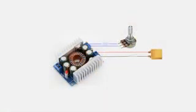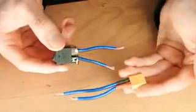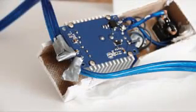Now solder on a female XT60 connector and a switch to the regulator's input. This type of connector is well suited for high current applications, and it is frequently used with LiPo batteries. Remember to use heat shrink over the solder joints to protect against power shorts. Now make a little enclosure for it out of MDF, but make sure you leave the heat sinks exposed as they will get quite hot. Now you can solder the LED panel's power wires to the regulator's output — make sure that you get the polarity correct, and use plenty of electrical tape between the wires to prevent any shorts. Although not pictured, solder two more small wires to the same contact points, as they're going to power a small fan to keep the regulator's temperature in check. Now you can glue the dimmer circuit to the back of the panel, just above the tripod mount.